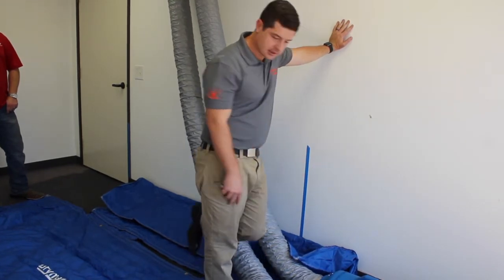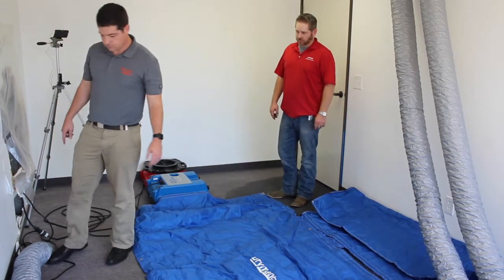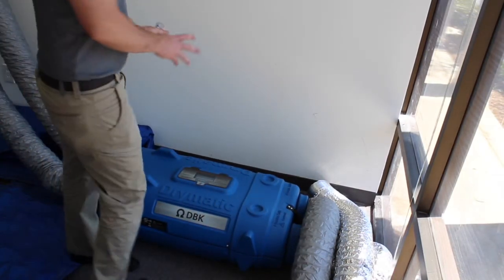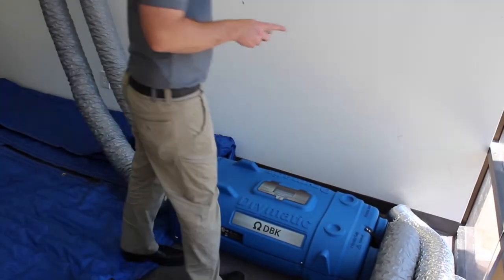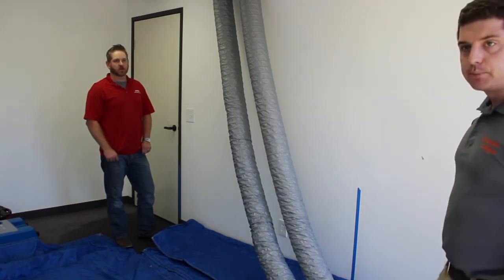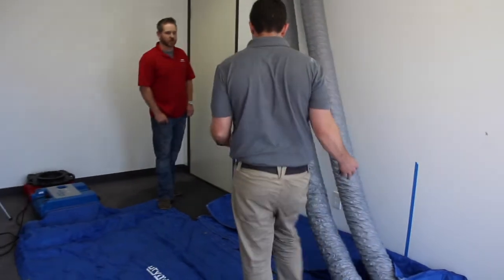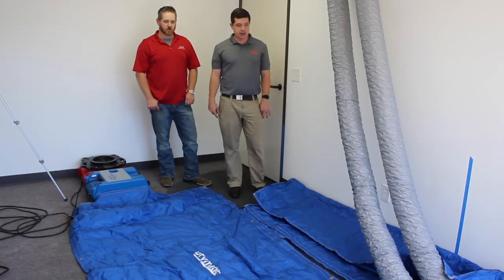The room intake is on the far side of the room — you want kind of a cyclone effect — and the heater outlet is getting nice and hot over here, blowing heat right into the affected area. There was a little water that seeped into the rug, so putting that heat there should take care of it. I want to experiment: in past performance drying work with infrared heat lamps at 1,500 watts, I've melted cove base before. We're going to run this equipment all the way up at 122 to 140 degrees Fahrenheit out of the booster and put the heat right on the cove base to see what happens.